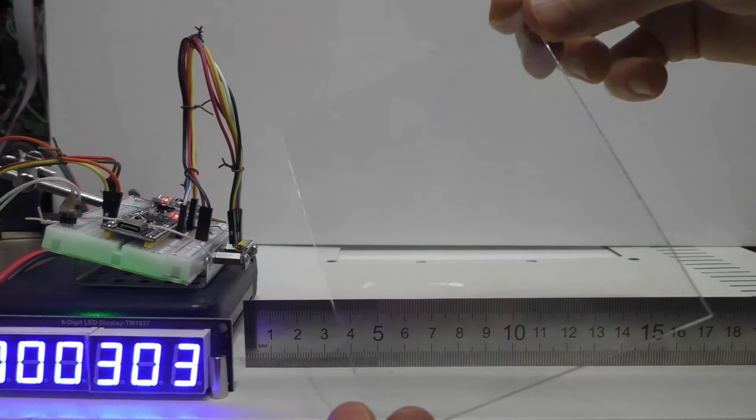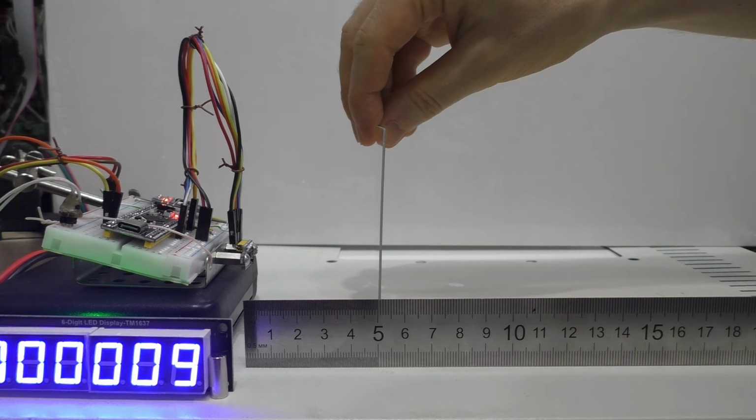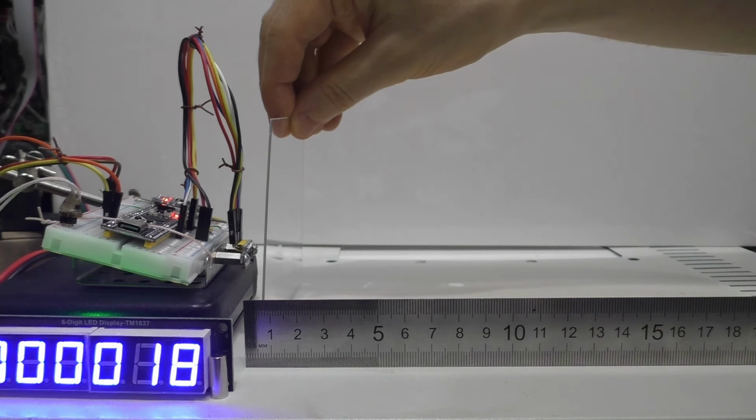The next object was transparent plastic. And that's where things got weird. The sensor is stable enough to show the measured values, but they are not correct at all. At a distance of 3 cm from the sensor, the values become zero. It seems as if the laser pulse through the portal goes into the past and its travel time is zero.